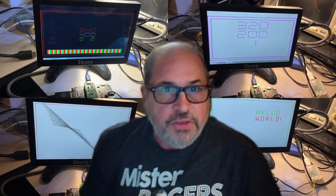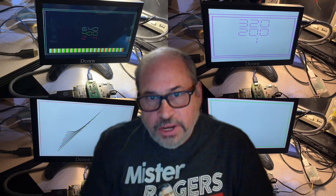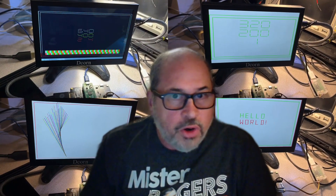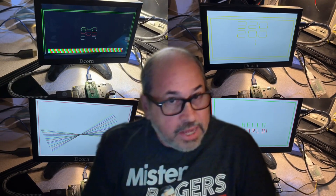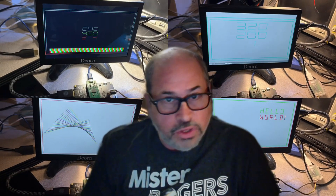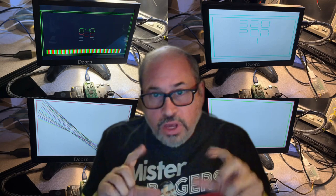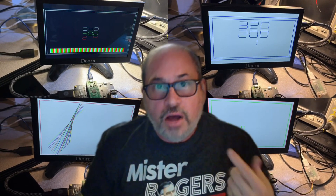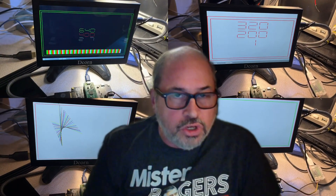Hey Frank and Friends, it's Greg Smith aka Dr. Frankintosh, and today I have the simplified interface to Pico DVI. You may have seen Pico DVI - it's the classic demo of doing HDMI on the Raspberry Pi Pico, but it hasn't really evolved since it was first released. Today I've got a simplified interface that will give you 640 by 480 pixels, or 320 by 240, or any vertical in between, plus up to 3-bit planes of graphics and a small graphics package so you can draw lines and such.